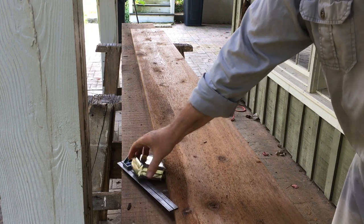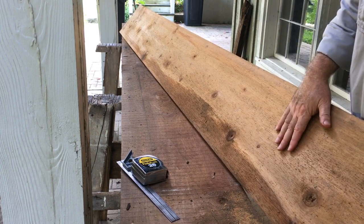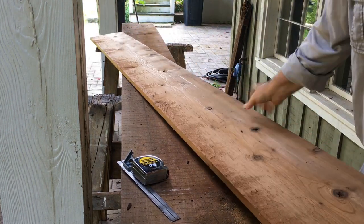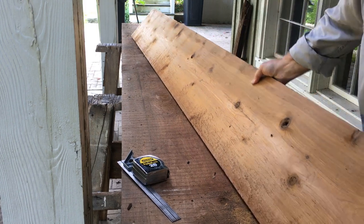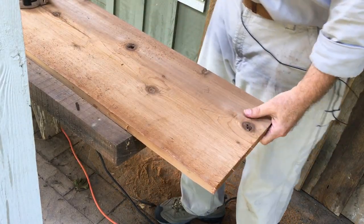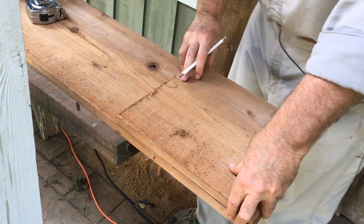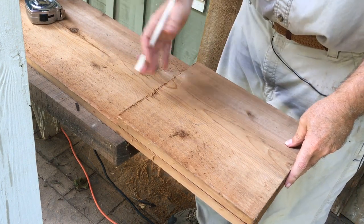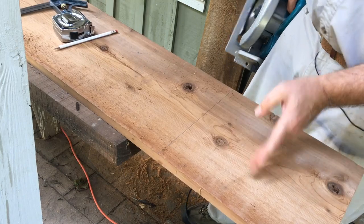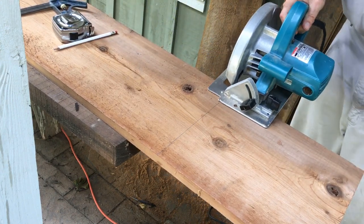Here we have a nice piece of cedar left over from the construction of my own home. You can see it's loaded with knots — it was clearly the worst piece of lumber, the one the builder kept rejecting. It's too good to throw away, but it'd be great for part of our sawhorse. Now, in carpentry a lot of times you start by creating a pattern piece. You mark it with a 'P' for pattern, and then rather than measuring over and over you just use that as your guide. You don't want to use the next board as the pattern for the one after that because there'd be variance — you want one original pattern that all the rest are mirrored images of.